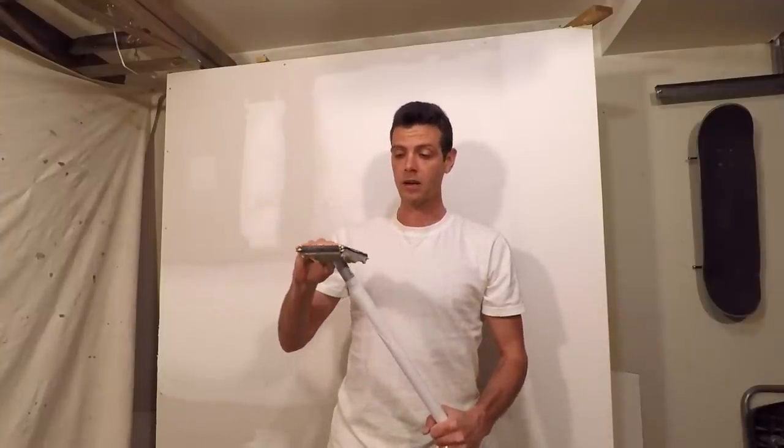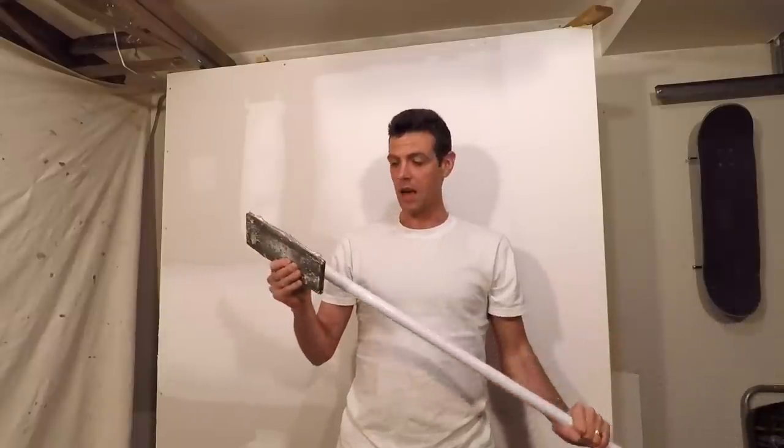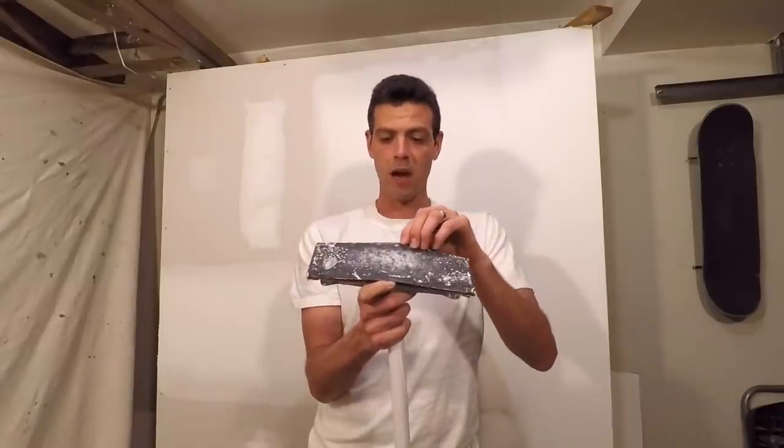Now let's get to my old faithful, my favorite — the Better Than Ever Super Sander. This is the one I wouldn't be without. If I had to choose only one, this would be it. It's reasonably light, not as light as the Black Widow. What I like is the narrowness of it. This is just paper, and I use this for sanding my first coat. It really planes things down nicely if there's a fair bit of humps in your first coat — very good for burning down liftoffs and leveling things out.